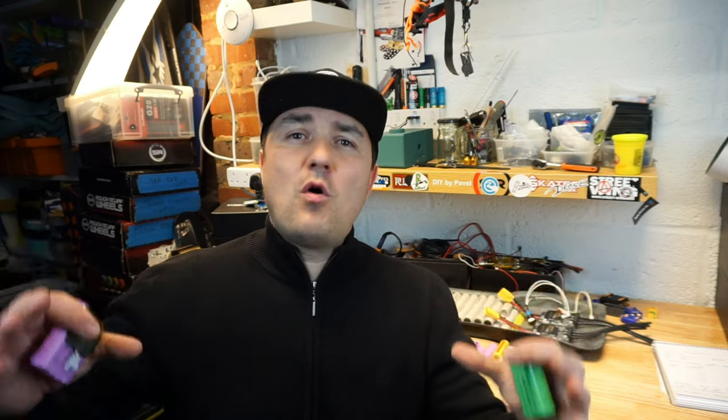Any lithium ion pack is actually a configuration, or result of different configurations, between parallel and series connections that are put together to your specification. So if you have a 4P pack, you only have 4.2 volts, and this is not enough to run your skateboard. Normally, they call it the golden middle, or the golden battery, 10S, and then people go for 4P, 6P, 8P, 10P, 12P, whatever. You can make as many P's as you want.